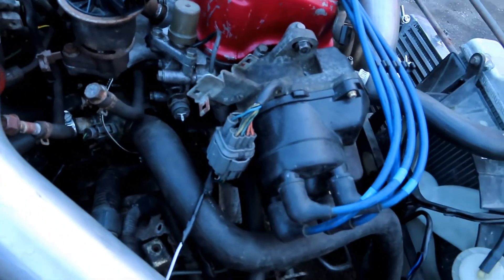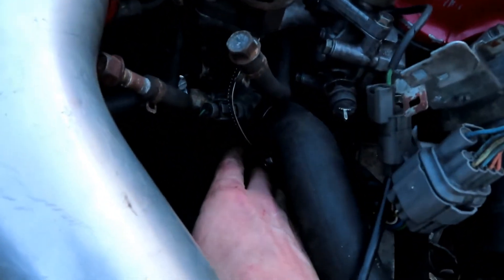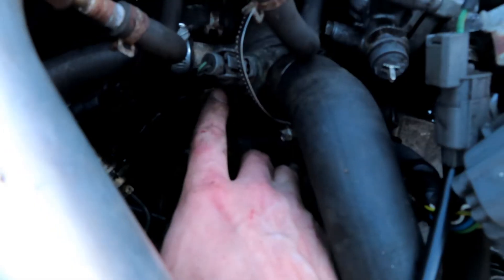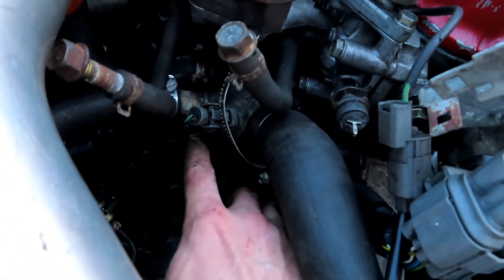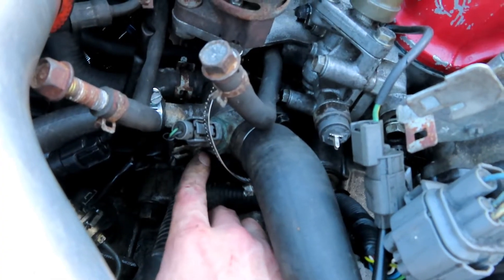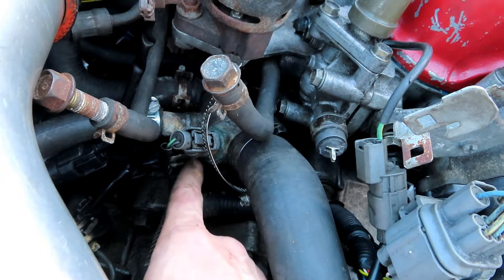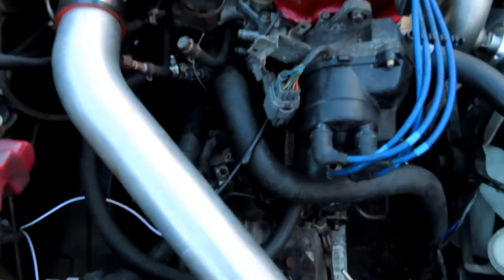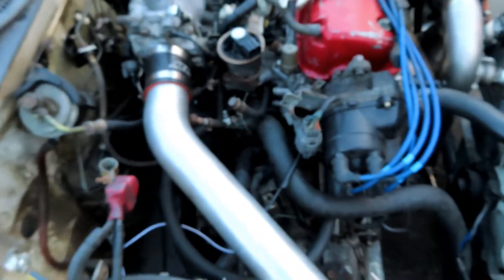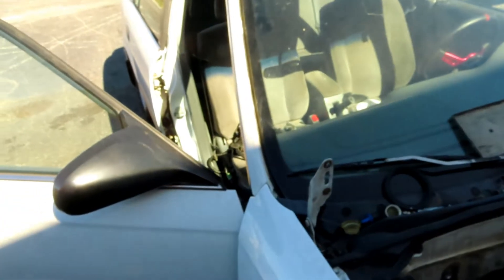Give yourself just enough wire so you can add it right here. There is a ground right here for the thermostat - this is the engine harness ground. You can go ahead and tap into there. The red wire you're going to want to run there, and then run another wire straight down and into the engine bay, just like we did for the solenoid. Now since we got this finished here in the engine bay, we're going to move to the ECU portion.